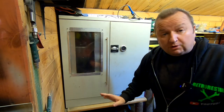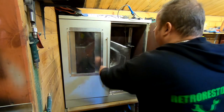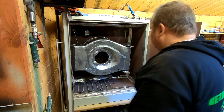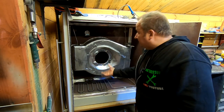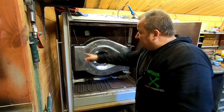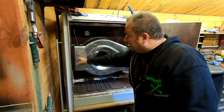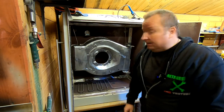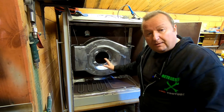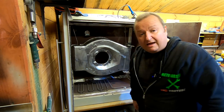I've rubbed it all down now and just wanted to try it for size, see if it fits in my powder coating oven. So as you can see, hanging it sideways - it was a bit too near the elements when I had it the other way up, because the elements actually glow red in this and I didn't want it to burn the bottom edge. So I turned it sideways and it hangs up quite nicely in there. I'm going to take it out now and clean it down with some acetone.